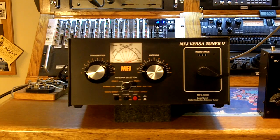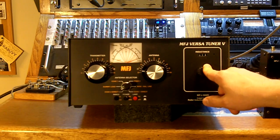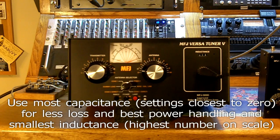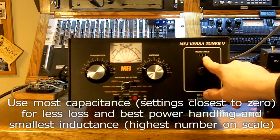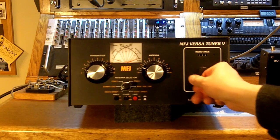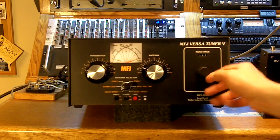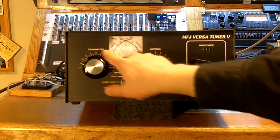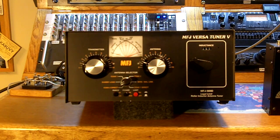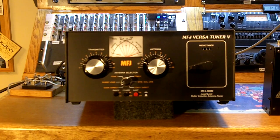Something to keep in mind when you're tuning: you want to shoot for maximum capacitance and minimum inductance use. That'll help keep your losses down and the tuner will be able to handle more power that way also. So generally when tuning you want to try to find the points with the most capacitance and the least inductance. In this tuner we start out with the least inductance being at 90 on the counter. As you turn it, you'll see the numbers change. The numbers on your dials are just reference points — they don't necessarily mean anything in particular.